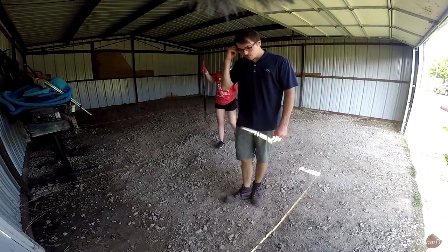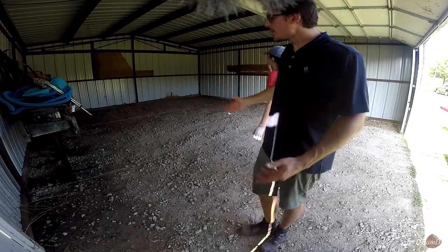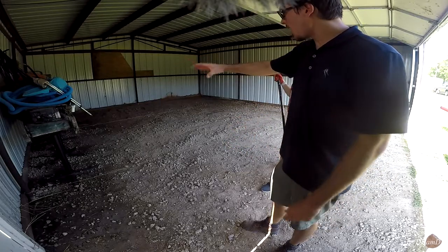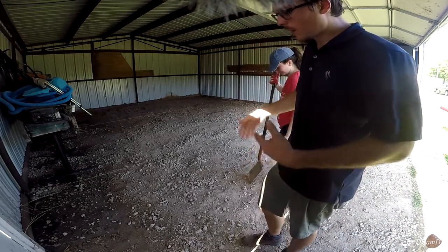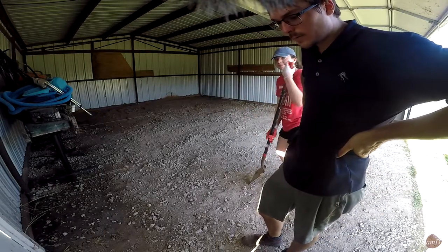Welcome back to the MDI line. In this episode we're getting the slab ready for the concrete. It was already pretty level but we've done a great job getting it more level. We're going for a four inch slab, so we ran two strings going across and then two strings diagonally. From there we're able to check where we're low, where we're high — and we're doing it all by hand. That's been the prevailing theme.